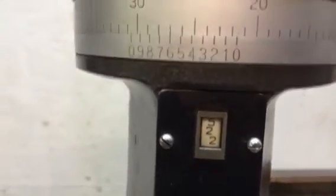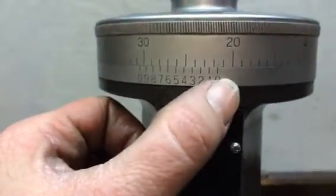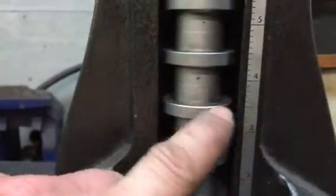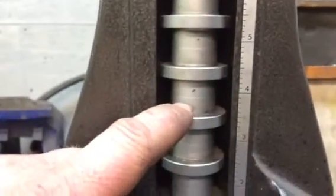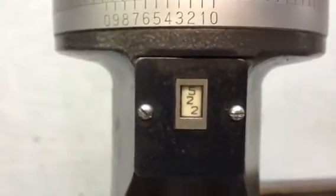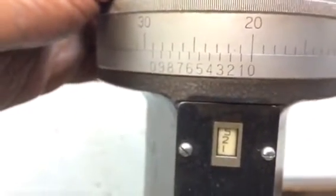Up on top here, this is your ballpark number — you really work with the vernier gauge. I needed to go to three inch, so that tabletop is between the three and the four. I needed to be three point five twenty. I'm at three, and the quick gauge there says it's five twenty-two — and there's the five twenty.